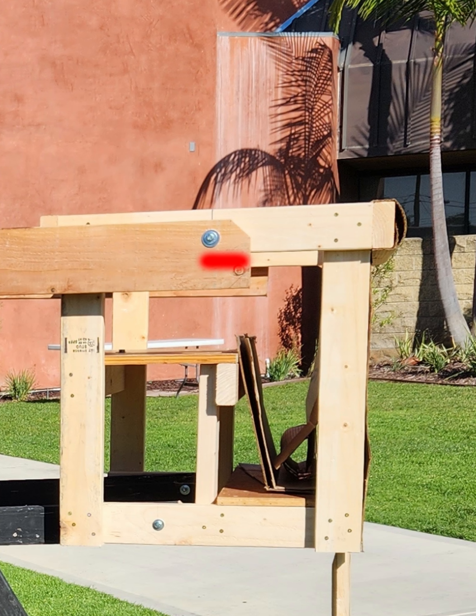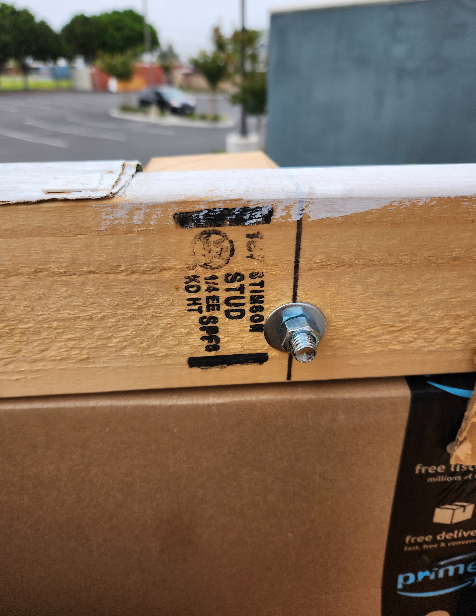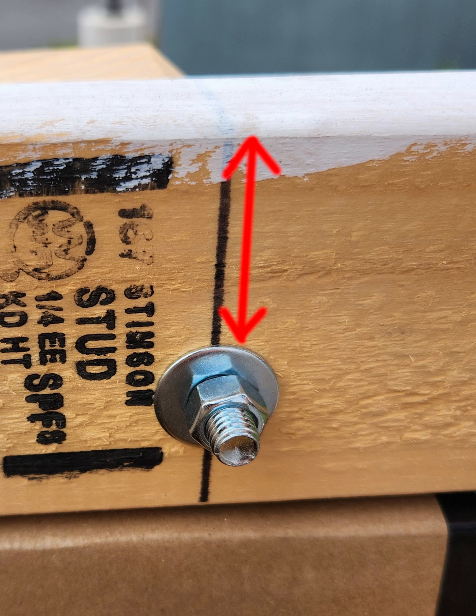The cross beams themselves were eight-foot two-by-eights, so that gave me about four feet from the center point to the end — just a little bit less than four feet. I set the pivot points on the basket and the counterweight rack about three inches in from the end, which left enough wood there to give it enough strength to lift a heavy load.